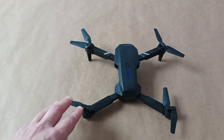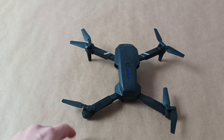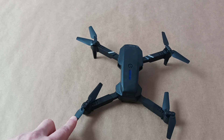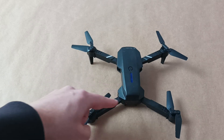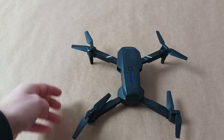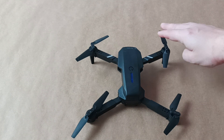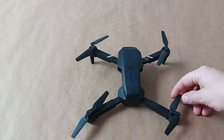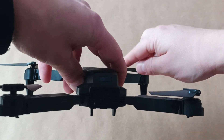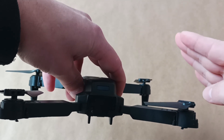This dirt with lubricant may affect the movement of the propellers. Before you disassemble this drone, make sure you make a photo or make a note on how these propellers are mounted. Some motors rotate in one direction and some motors rotate in other directions. That's why if you look at the blades of the propellers, they are mounted differently. If you look at the blades here, they all have some kind of an angle. For example, this blade has this angle, but this blade has this angle, so they are mounted in a different manner.